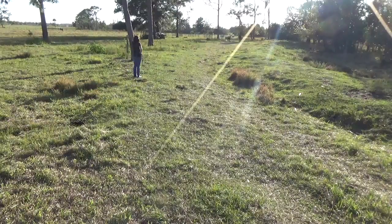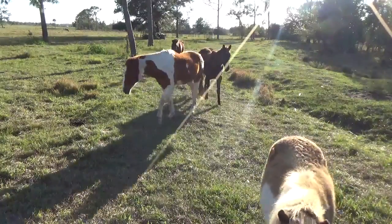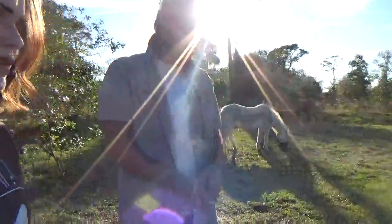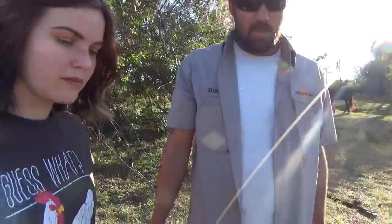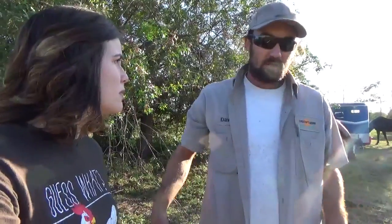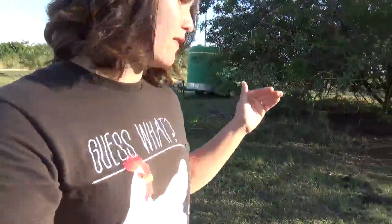For each skid we're doing two to three inches deep, two runs. We've got four-by-four boards, so we want a little bit of drainage on each side of the board — eight inches wide, 14 to 16 feet long. For a foot wide you're at about five bags per 14 feet, so we've got a total of 10 bags. We'll lay them all out, pour them, and get it all prepped and ready.